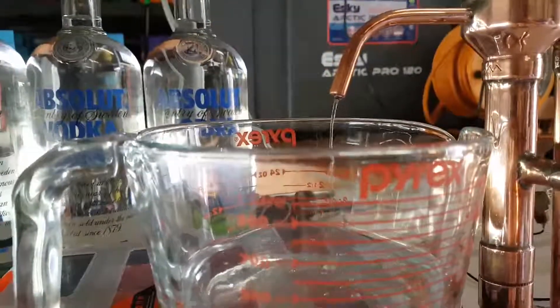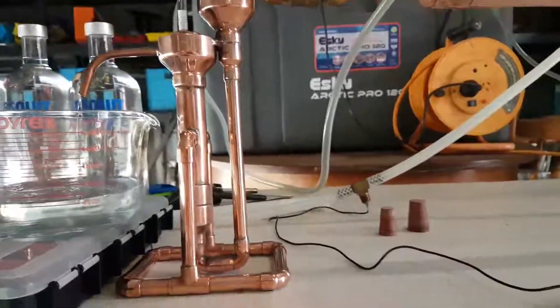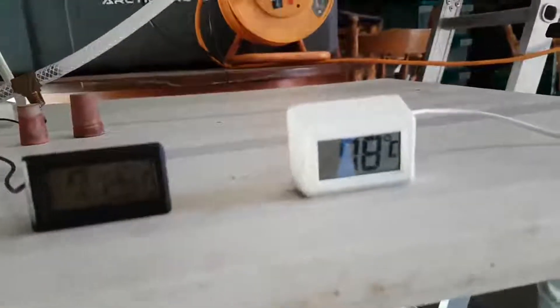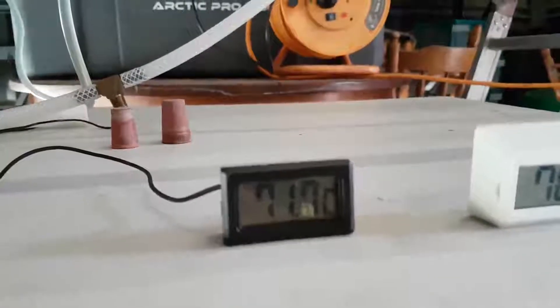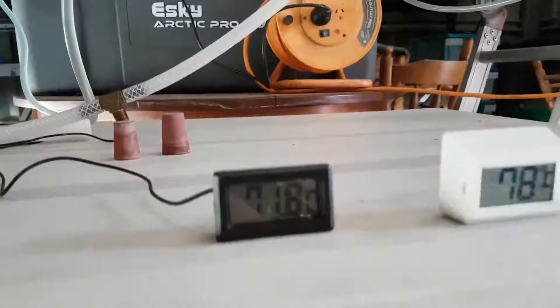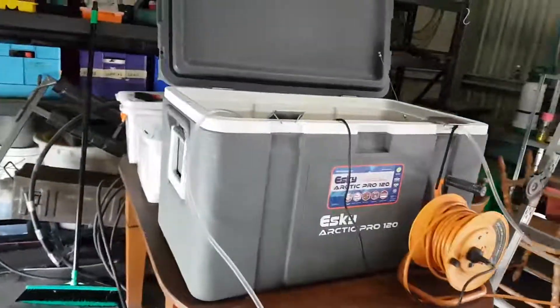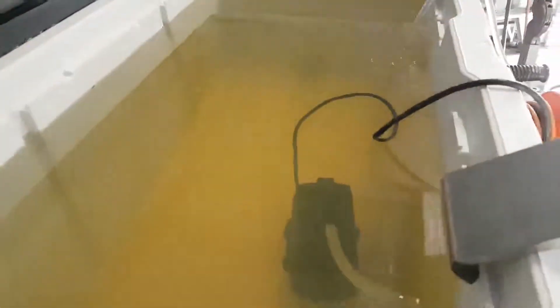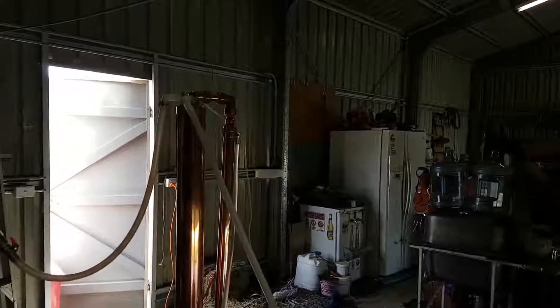It's still a nice little stream running. 78 degrees on top of the reflux condenser, 71.1 on the outlet water temperature from the reflux condenser. It's the esky and a little fountain pump that's inside the esky — it just recirculates the water. That's returned back into the esky, coming from the reflux, from the vertical condenser, and from the pump.